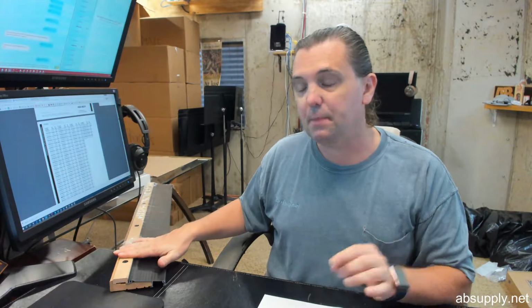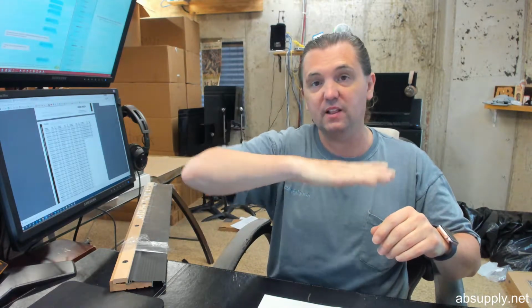The adjustable top is available for up to a 1/4 inch adjustment so that you can contend with maybe a sill condition that's not level or a door that's really not cut straight or hanging plumb in the frame, or maybe the frame is installed in a parallelogram sort of situation.